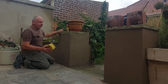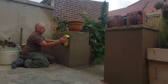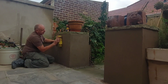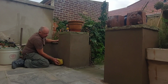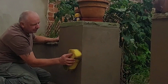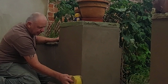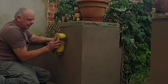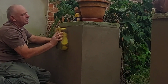Well, this one, I'm nearly there. It's drying at different rates to this. So, a problem when you're going on to the scratch coat that's been on for a year or so. I generally like to go on them either the day after or a couple of days after. Well, we've still got a bit of dampness in them, but yeah, it didn't do last year.